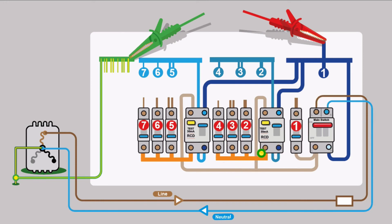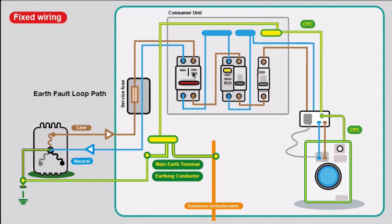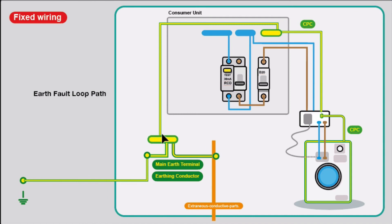You need to isolate the line so you're not testing anything live — that would be dangerous. This neutral also goes through the RCD onto the other neutral bars. Disconnecting a neutral on an energized circuit is extremely dangerous because that neutral will no longer be a neutral; it becomes an extension of the live conductor. When doing insulation resistance testing, all we want to test are the cables — making sure no voltage can appear on extraneous or exposed conductive parts. We don't need any supply, no incoming power, and no connection to the transformer apart from keeping the earthing system and all bonding conductors in place.